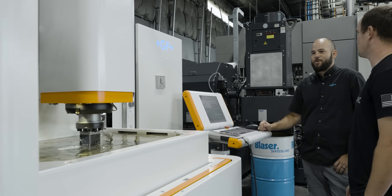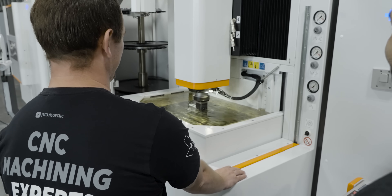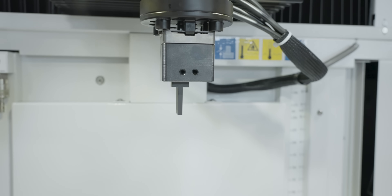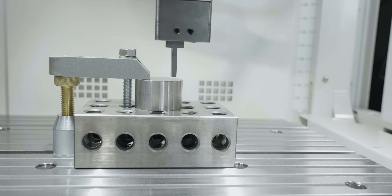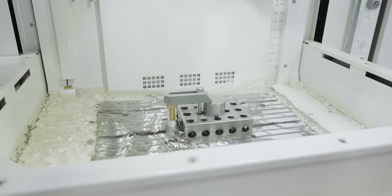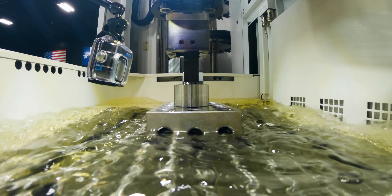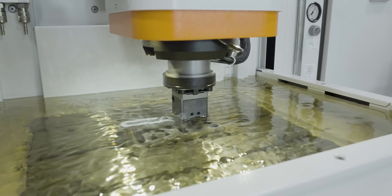GF came in, set the whole machine up — we got the air hooked up, ran the electrical, everything is ready to go, and we've even done test burns already. To set up for our first burn, we put our 2-4-6 block right here to raise our part up off the table, then got our low carbon steel block, burned our slot, and burned in from the side — and it worked perfectly the very first time.